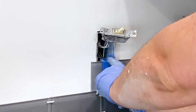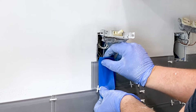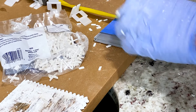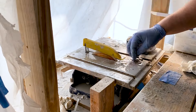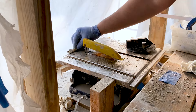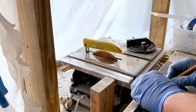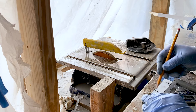To measure for the outlet cutouts, we put painter's tape on the tile. We use this method because you can't really write on glass tile without markers, and those don't always come off so easy. We use the tape for the width measurement and mark the height on the tape with a pencil, accounting for the 1/16th inch spacer. Every time you go to the wet saw, make sure you keep it clean of any off-cuts and debris. With the saw ready to go, we use a speed square to extend all the line markings and transfer the measurements to the back of the glass tile as well, in case we need to see how deep the cuts are from the bottom side of the tile.